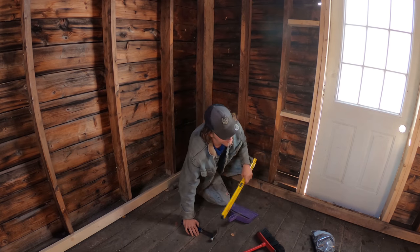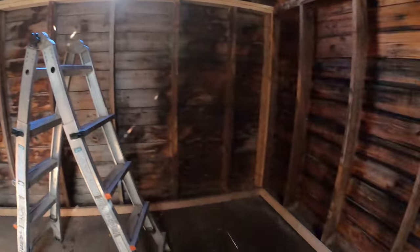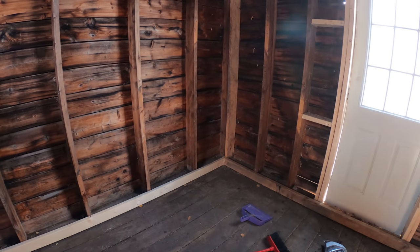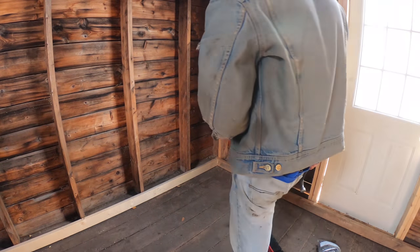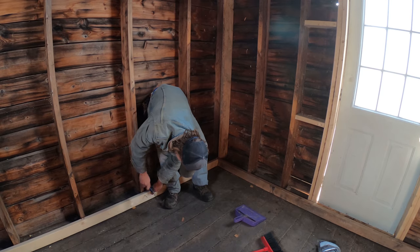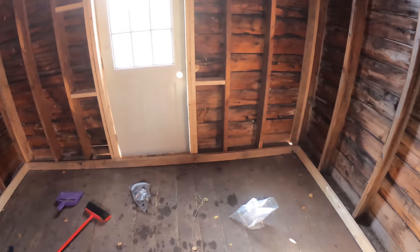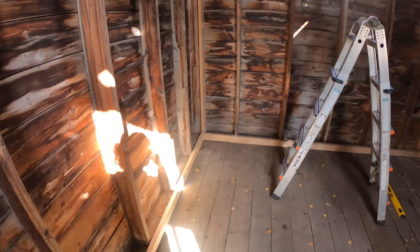I'm down close here — nearly perfect. I'm going to struggle to get this any much better, to tell you the truth. She is just near perfect. Once we put our boards here, and we have a couple joists that aren't perfect but straight, I'm not going to play the game of millimeters. What I'm going to do here now is nail it into every single stud. I am going to nail it all the way around to the bottom plate and to every stud. That'll be just damn sturdy.